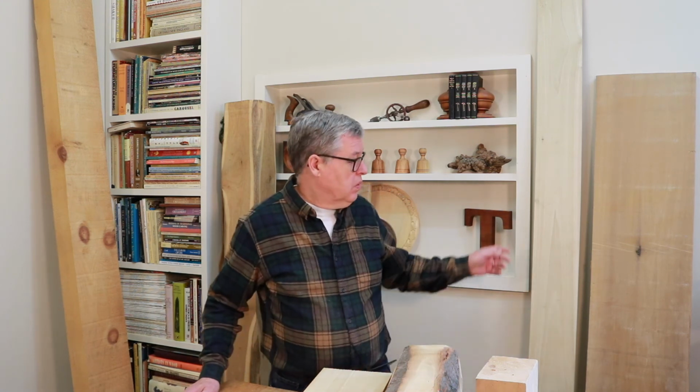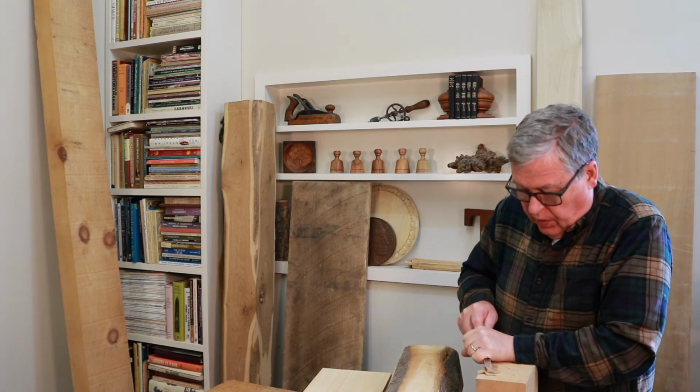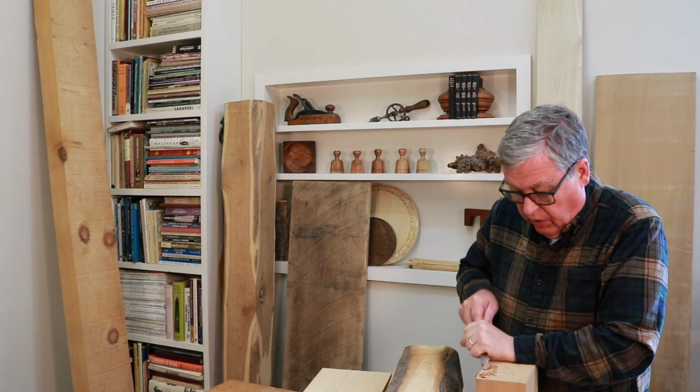This has been drying for over 30 years. Generally speaking, air-dried wood is 1 year per inch. And if you're not that patient, you just consider that a 1-inch board just takes 6 months. Some of these woods are very stable, so you can carve them a little bit on the green side and they'll be okay. I'm carving the end grain of basswood, and that's kind of my end grain test.